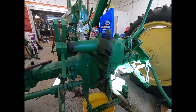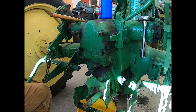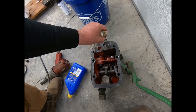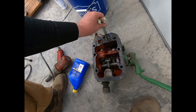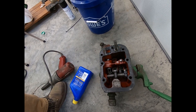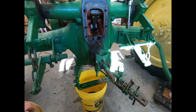There is a spring and a plunger in the backside of these — you've got to be careful of it. When you take this off, you've got to be careful you don't bend this little valve spring. That's one of the critical pieces. Some of the other ones are a little different — some actually have a valve that will come right out, but that's on the John Deere A's. They're not all the same. Some are Power Trolls and I don't remember what the other name is, but whatever it is, it is.